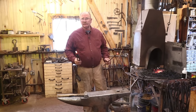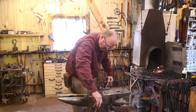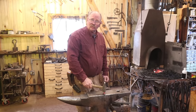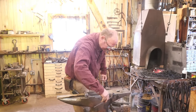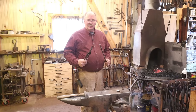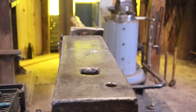It pays to rehearse this kind of a weld before you try to bring it up to heat. I know that this piece has to be face up on the anvil and this piece has to hold it in place while I drop the tongs, pick up my hammer and make the weld. There's a little coordination involved and the more you practice it without welding, the more likely you are to get it. It's also better to practice on things that don't matter before you try something important. This is also a place where pieces tend to want to skitter at high heat - borax flux seems slippery to me, so I use Iron Mountain or Easy Weld instead, which is a little stickier.